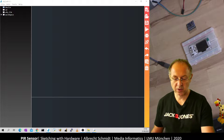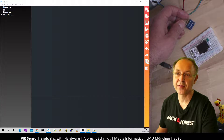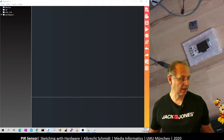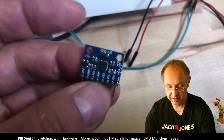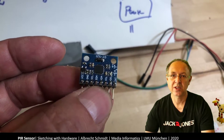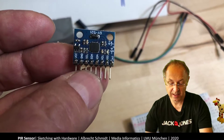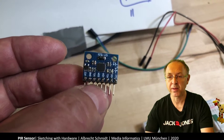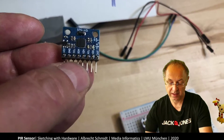In this tutorial we look at how to connect an accelerometer and gyro sensor, the MPU6050, to our board. The chip can be connected via I2C bus, so we don't need many connections. We have to connect VCC, ground, SCL the clock, and SDA the data. The others we can ignore — they can be used if you use multiple chips to have different addresses — but we only need four connections.